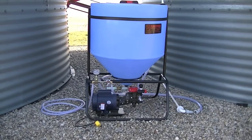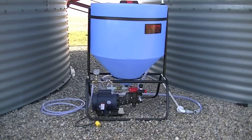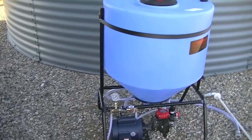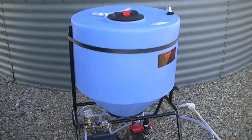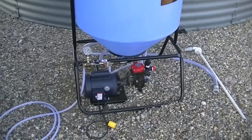Now let's have a look at the mixed tank and pump system. We've got a 240 liter mixed tank, and attached to that we've got a high capacity high-pro pump that is going to provide about six gallons per minute pumping speeds, which is valuable when moving product from a tote into the mixed tank as well as agitating the product within the mixed tank itself.